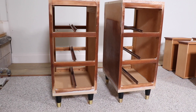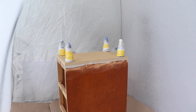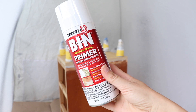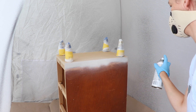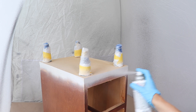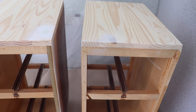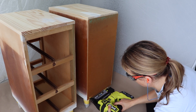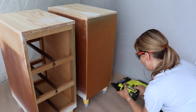We're looking a little more like nightstands! I'm going to mask off these feet and then start priming. Since the bottom is MDF I need to seal that before adding any water-based products, so I grabbed some BIN shellac-based primer and I'm sealing off the portions that are going to be painted. It's also a great sealer for knots, so I hit those up as well. Then I'm grabbing that brad nailer again to attach the backs on before I prime.